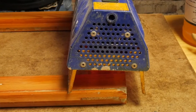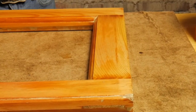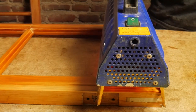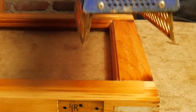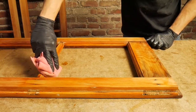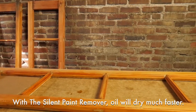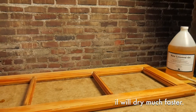The heat thins the oil and quickly pushes it deep into the substrate. You may see it disappear into the wood as if the wood is a sponge. Wipe away any excess if needed with a clean rag or microfiber cloth. Let sit for 24 to 48 hours in ambient temperatures of 60 degrees or more.